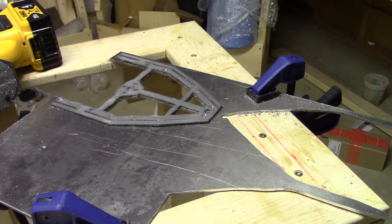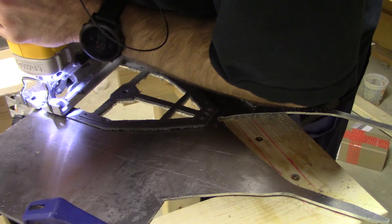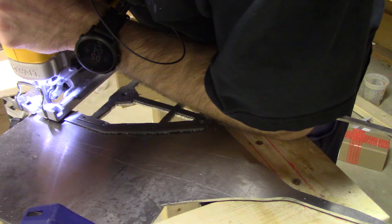I finished cleaning up the inside pretty well — it's not perfect, but when using a jigsaw like this, if your robot really depends on millimeter-level accuracy, this probably isn't the best method. With MicroFlash Delta there's a little bit of slop, and that's not a big deal. I just try to get as close as possible since I have all the mass figured out in grams and I want the final frame piece to be within one or two grams of what it should be. Now that the inside pieces are cut out, let's go ahead and separate it from the rest of the aluminum.